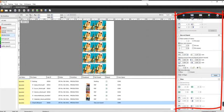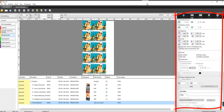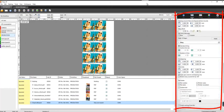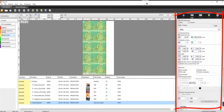If you're going to be doing a large banner job, you have the option for tiling. If the nesting needs to be tiled for application on a wall, you can set up a custom tile size. If your material is only 48 inches wide and you need a one-inch overlap on the right side for tape, hit apply and it will turn this layout into a tile for installation.